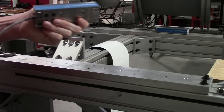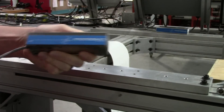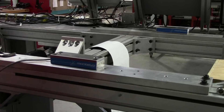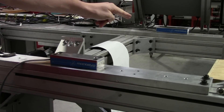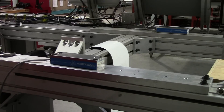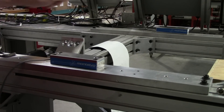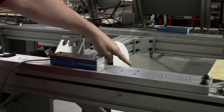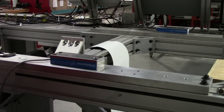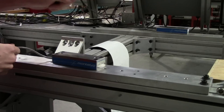For this demonstration I'll be using Montalvo's U-25 load cells. When mounting your load cells you want to match the direction of the cable with the direction of the resultant force applied to the roller. On my application here the web will wrap around the roller I'm going to install and down to the roller beneath it and then back up to this roller. Resultant force is the center of the wrap from where the web first contacts the roll to where it makes last contact. So for my application, first contact will be about here and last contact about here, making the center and resultant force in this direction. So I will want to install the load cell so that the cable is going in that same direction.